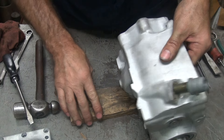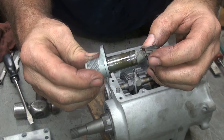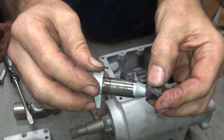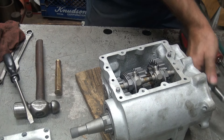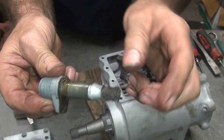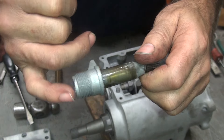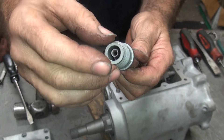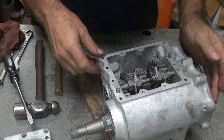You can see how the teeth are all gone — they're all worn off. But it is frozen too. These are fresh marks right here where I ripped it off, but it was already gone anyway. So this drive unit is completely frozen up — it does not move. Now, these are rebuildable. We can take the gear out; it's on a shaft, and they make replacements. You can also find all the original ones that can be replaced. Or you can get one that has a bad gear, take the shaft out and push it back in. There's a bushing in here, so you have to push the shaft out of the bushing, put it up in here, and then put the bushing back over. It's a collar that holds it in. So some stuff is repairable.